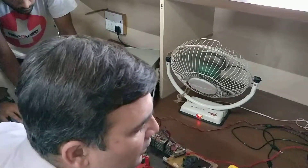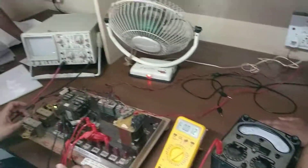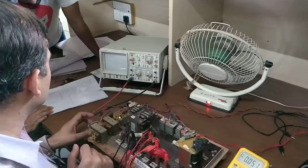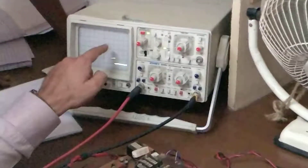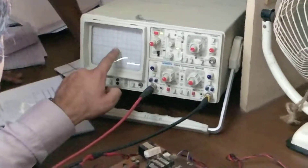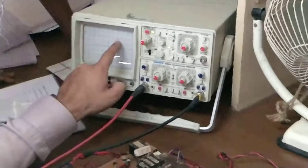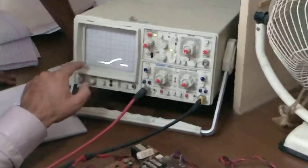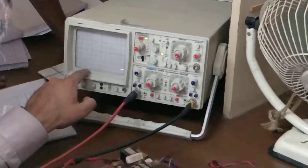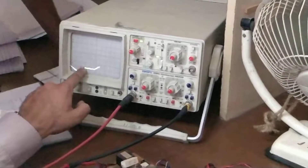Just now alpha is very large, let us make it very small. Let us increase alpha. So this is the load voltage. This much portion is available across the load. This is the negative portion and this is the positive portion. When the load is not on, the SCR is in the off state.